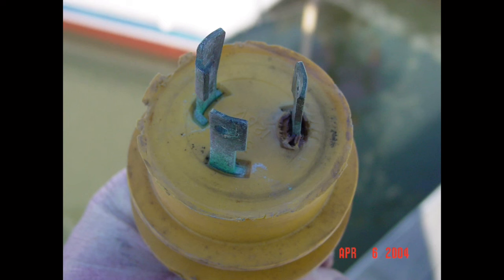And here's another tech and safety tip. If you find a plug that's burnt or charred, don't just replace that. Check the inlet to see if it's burnt as well, and vice versa.